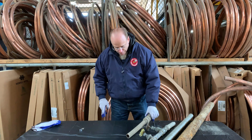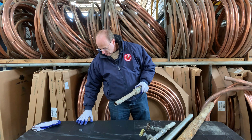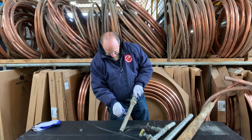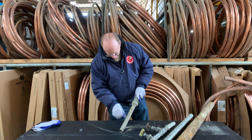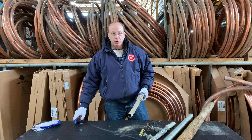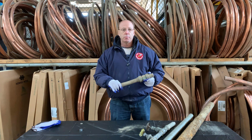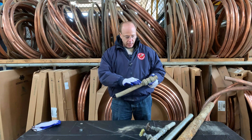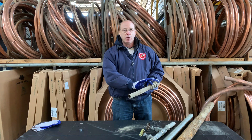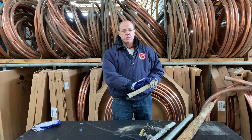For instance, copper lines — like this is an old copper line, it's discolored. If you scrape it off, you could just use a coin. The orange color, the copper color, will come through. The other distinctive thing about copper is the way it's joined to brass fittings: it's flared. This is a flare fitting. So if you have a flare fitting, right away you know you have a copper line. Copper in New York City has been used exclusively for about 50 or 60 years.